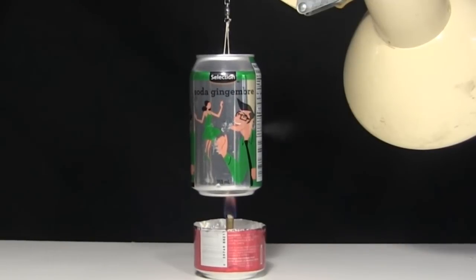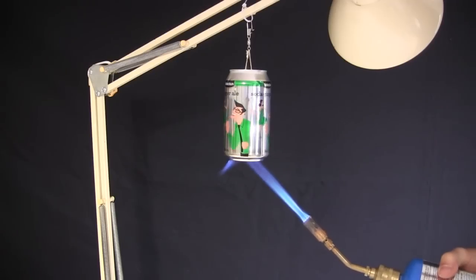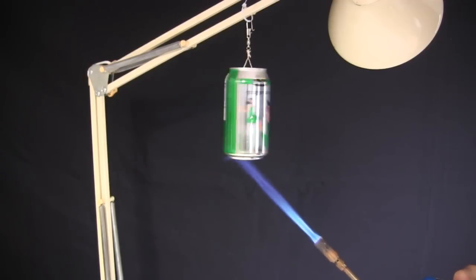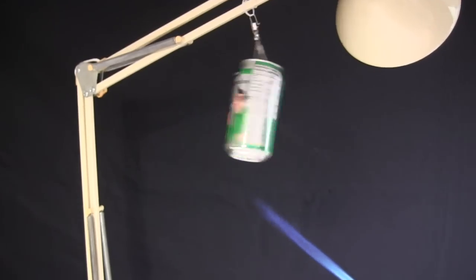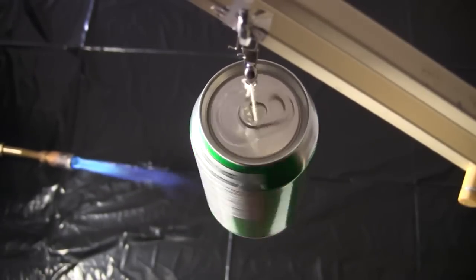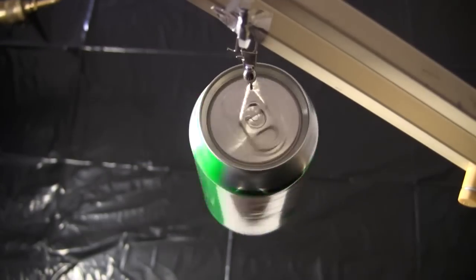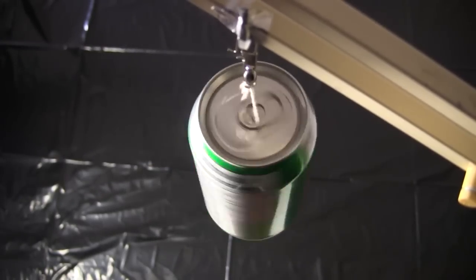But even up to the point that all the water is boiled away, I get only slight rotation. So I get out the propane torch for more heat. After putting water back in the can I try again. After around 30 seconds heating it up, it starts spinning — though it gets a little chaotic, so I back off. Watch out for the hot water flying out when the can is spinning too fast. From the top you can't see the steam coming out, probably because of rising hot air from the torch flame. But when I apply heat and remove the torch, you can see the steam come out briefly while it's still hot enough inside to produce steam.